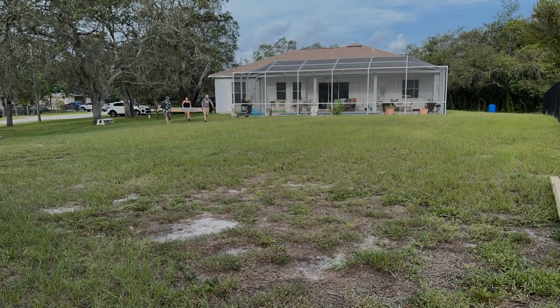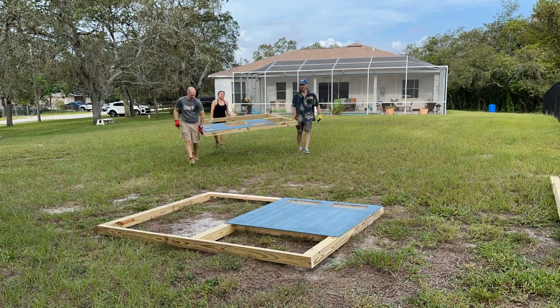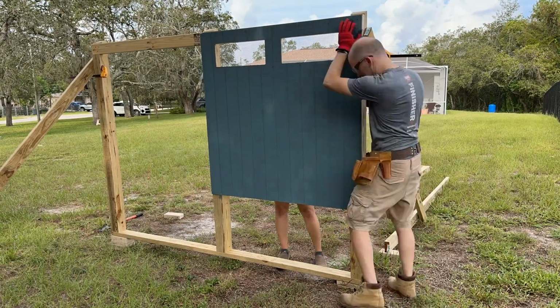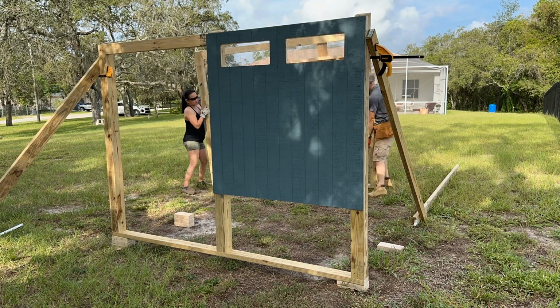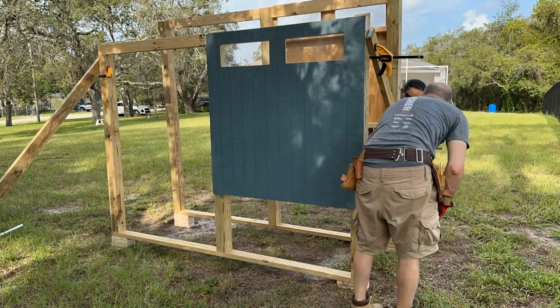The wall panels were fairly light, but we were glad to have our son lend a hand as we carried them from the garage. This corner of the yard is a bit uneven, so we used a few bricks to level the walls. Temporarily holding the walls in place by clamping a few long boards to them allows you to make quick adjustments as needed and get everything positioned correctly. Getting things right at this point will set the rest of the project up for success.